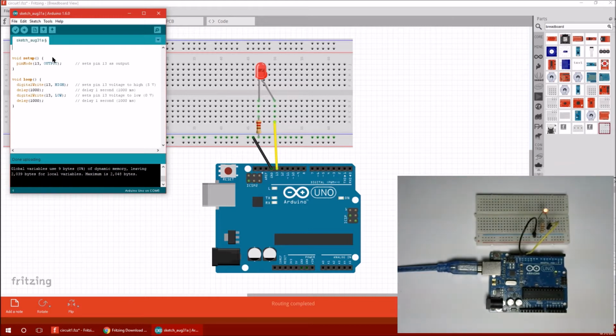So here's how you do that. I'm going to make a global variable up here, an integer named, I'm going to call it LED pin, and I'm going to set it equal to 13. Okay? So LED pin is 13. And there's a better way to do this too, but this is the most general. It's creating an integer variable. So its name is LED pin, but all it is is a 13. So wherever LED pin is, the computer's just going to stick a 13 in there instead.